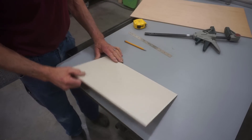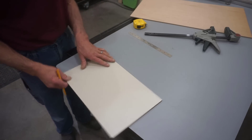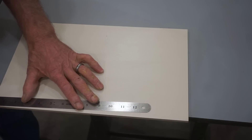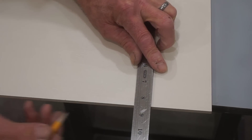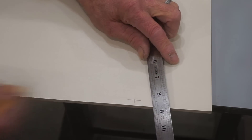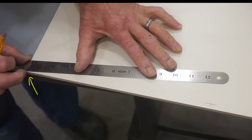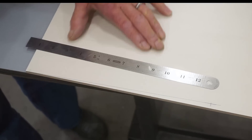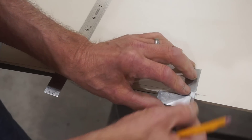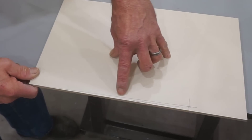To make the fixture I use for cutting shims, I use quarter-inch MDF — this piece is melamine coated, but veneer coated would work equally well. This piece is 10 inches by 16 inches, and I want to lay it out for shims that are 12 inches long. So I start at the end of the sheet and mark 12 inches. At 12 inches long, I want them to be 5/16ths of an inch thick. I need to notch the edge of this melamine so that all the shims come out precisely the same, so I swing the ruler to hit the cross mark at 12 inches and 5/16ths, draw a line, and square it at the 12-inch mark.